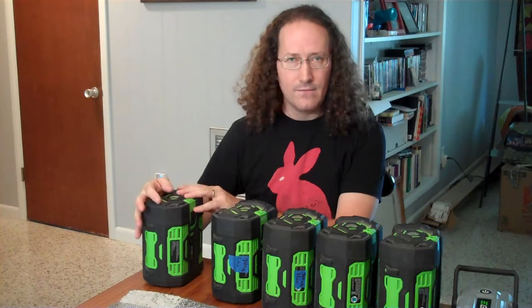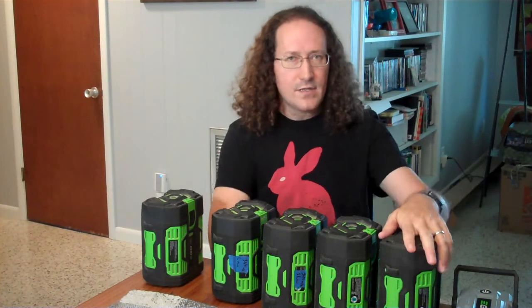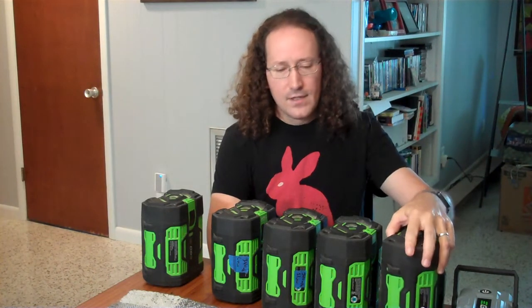This guy is doing pretty well. It takes about 240 watt-hours to recharge. Brand new it would take about 400-some watt-hours, but it's pretty old and it's doing half capacity — it runs the mower fine for half the distance as original. This other one, I don't know exactly when it was manufactured. It has a refurbished sticker on it and doesn't have a manufacture date, but my estimate is 2020. It also runs pretty well — it does about 340 watt-hours on the mower.